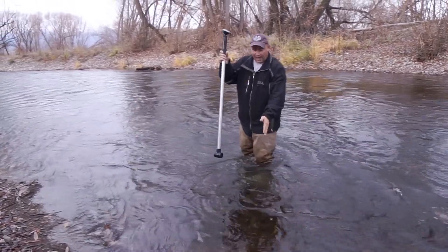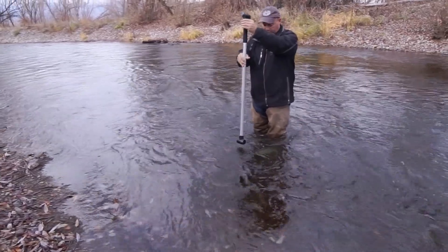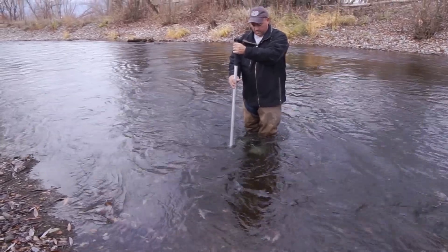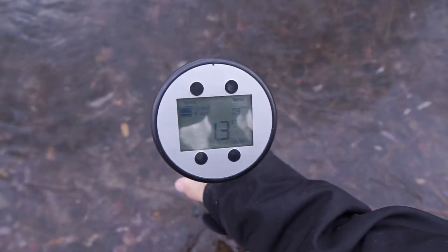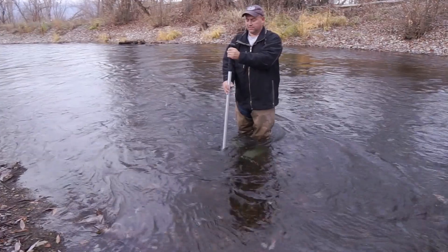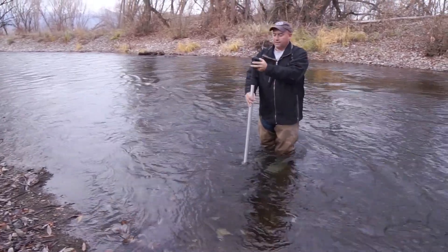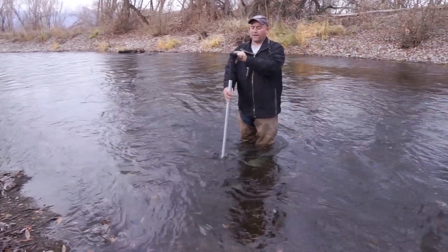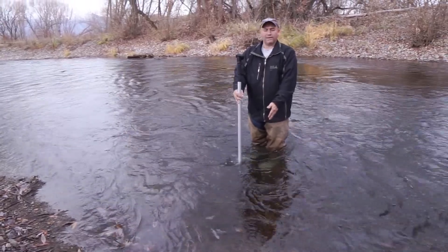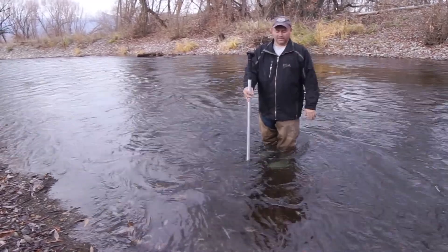You want to stand out of the flow range that is coming to the meter, but you will be able to insert the probe into the water, hold it vertical, and then on the display you will see a value for feet per second. One of the nice things about the flow probe is that I can hit this reset button, and one of the values it calculates is the average. So as long as I'm holding the flow probe in the water it is averaging multiple measurements that it's taking.